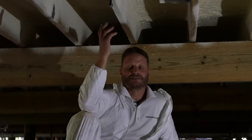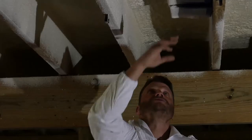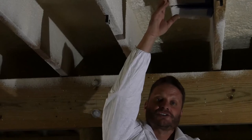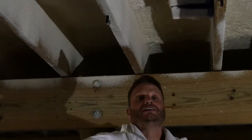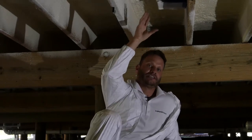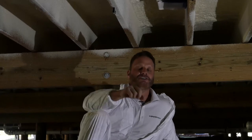In this particular case, this is a commercial building, and underneath the subfloor right here, you'll see these boxes. We asked the owner to talk to their electrician about installing these because there is a lot of wiring right here. I said, talk to the electrician, have the proper housing around it. We're going to seal around it with spray foam to get the air seal — that's what we're trying to achieve. Otherwise, for typical residential properties, we want to submerge the wiring. That is your air seal, your energy bills, your comfort.